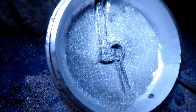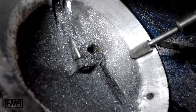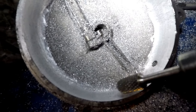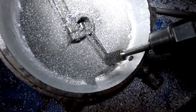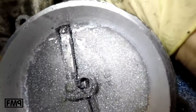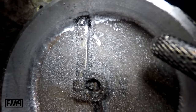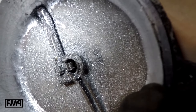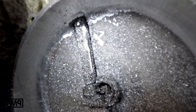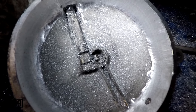That clutch lid — that's how it looks when you work on it with a compressed air miller. I removed material here; it takes about five minutes to do it. I removed that small beam here. The third thing: the lever, when the lever turns, it grows a bit, it comes a bit higher — and that's why I need to round this edge. Cleaning and assembling the whole thing.